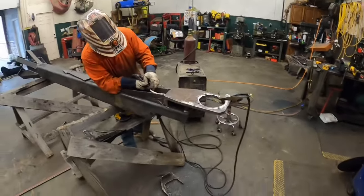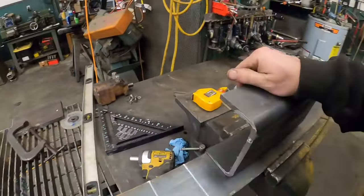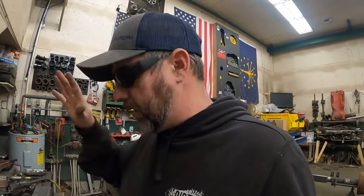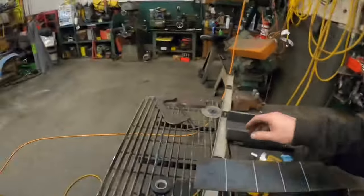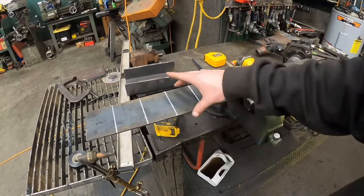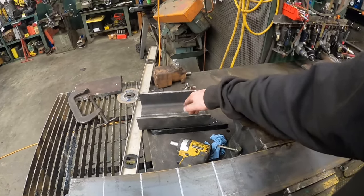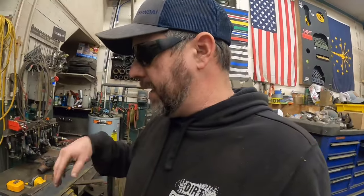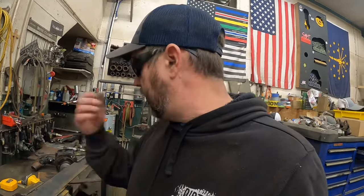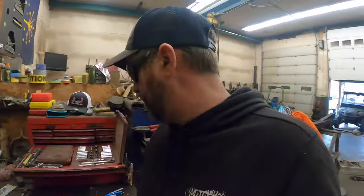All right. While you're welding that out, I'm going to start getting what we need for our cover down here. So here's the next thing we need to figure out. We need to put this piece back on, make it removable, basically make it accessible to get in there and work on our hydraulics, our gearbox, and so on. So what I think we're going to do, we'll take this piece of flat bar, cut three inch pieces here. We'll use these as tabs. Basically, we'll weld it on to the inside of the tube, let it overlap this an inch and a half, and then we may tack this in place, get the drill set up, and we'll drill four bolts down through there and probably weld the nuts from the inside. And that should hold everything in place. So let me get these cut. Hope by the time I get these cut, Aaron's got that welded, and then we'll get that process started.